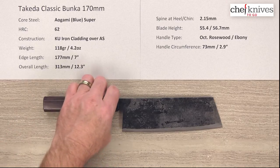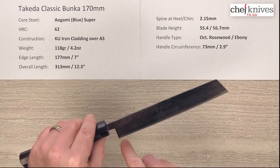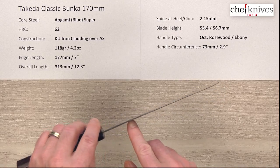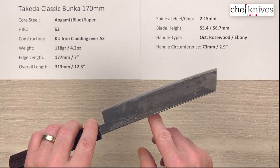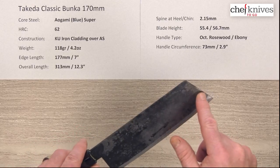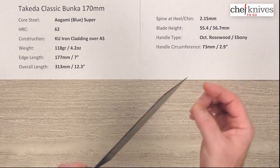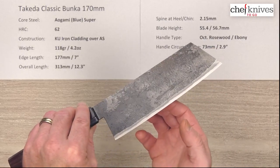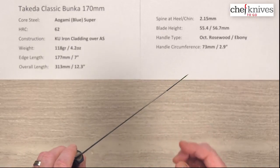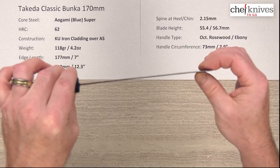The spine thickness is a little over 2mm coming out of the handle above the back of the blade, but it's hard to describe how thin this thing is — it gets really skinny off of that really fast. It's around 1mm up where the reverse sword tip begins, and then it's just skinny all the way until you hit the grind. They've got a pretty small primary bevel on these and it just thins out really at the very tip. This overall knife is really thin, and the stainless version is even thinner — it's hard to believe they can hammer these out.